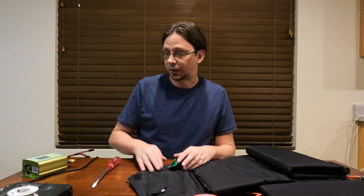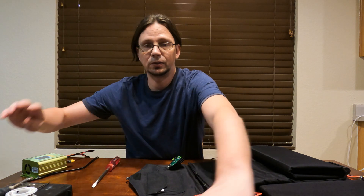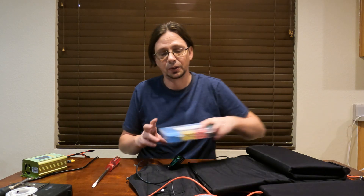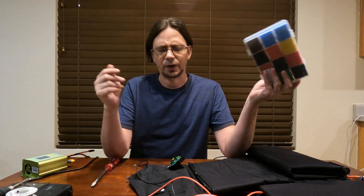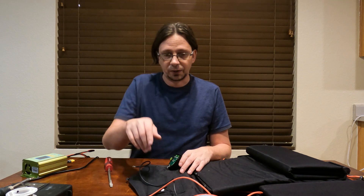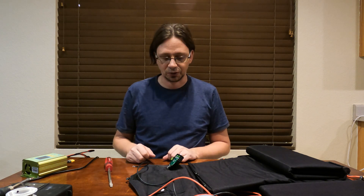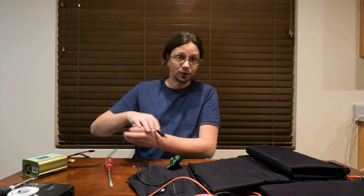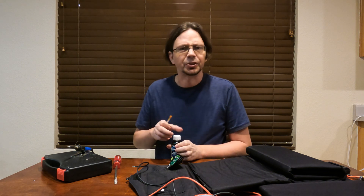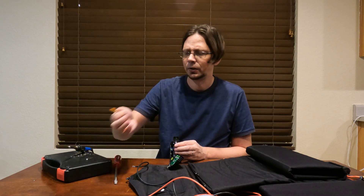I'm going to get my soldering iron. You'll need a soldering iron for this job — basically to take off the old wires and solder on the new ones. To make everything look pretty, I'll throw some heat shrink on it. All this stuff for the upgrade, except for the screwdriver and the silicone, can be found down in the description below. It doesn't hurt to have a thing of flux either — it really saves a lot of time with soldering because it gives you a cleaner removal and cleaner joints. Definitely a fan of flux, a little sticky downside but worth it.